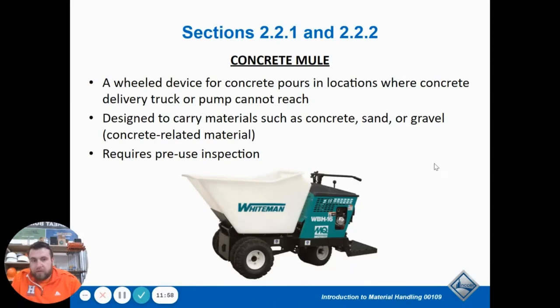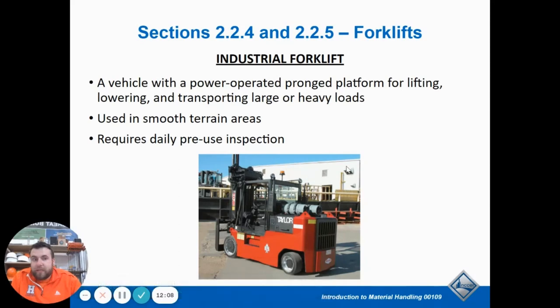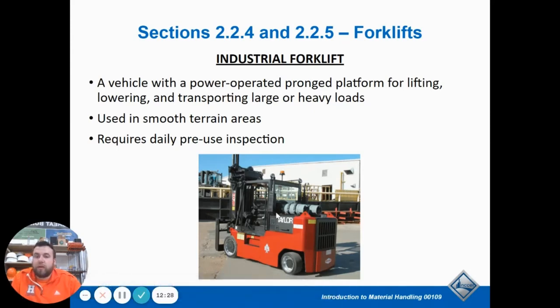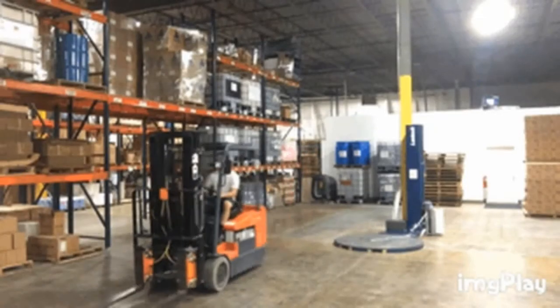Make sure you get trained on forklifts. If you work in a warehouse or at Lowe's or Home Depot, you can get forklift certified — pretty fun to drive and pretty easy. The biggest thing is just paying attention. The load isn't the same size as your vehicle, and forklifts steer from the back, so it's different from driving a car. It's almost like you're always driving in reverse — how a car maneuvers when backing up is how a forklift maneuvers going forward. They're also zero-turn, meaning they turn really sharp.